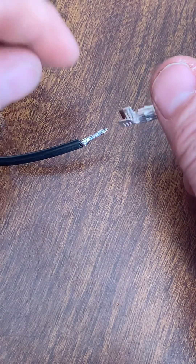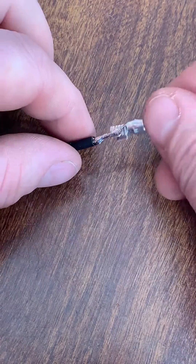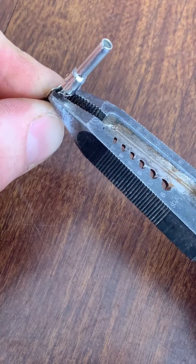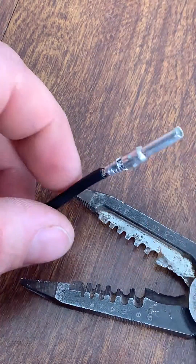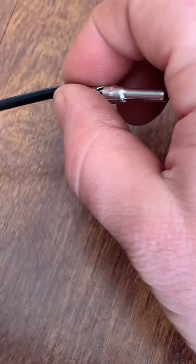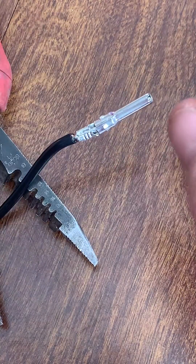I make all my own panel cables. This is how I'd like to do it — take whatever gauge you need to use, tin the end. There's the metal connector. I found that there's no good way to clamp these on there, so I'm just going to fold one over, fold the other over.